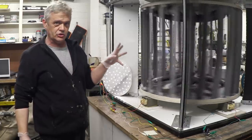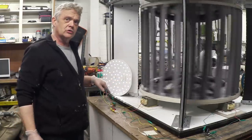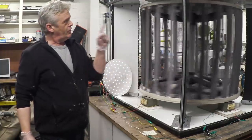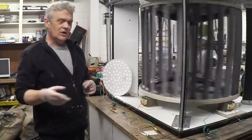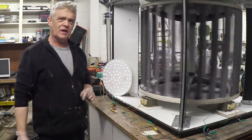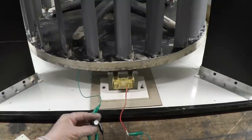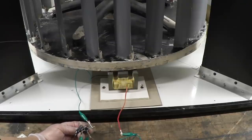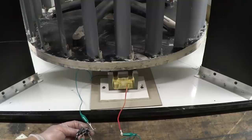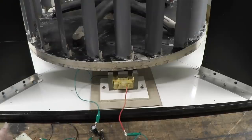We've got four coils generating and there's no slowing down, which is just superb. Now when I first did this and connected the coils up both in series and parallel, it would stop — the blower wouldn't actually work — and that was really curious. But then I did something. Let me give you a close-up. Each of those coils has been connected to a 50 volt 1000 microfarad capacitor, and at the bottom there are four 1N4007 diodes connected as a bridge rectifier. From the DC output on the rectifier we've taken it straight to the DC load.